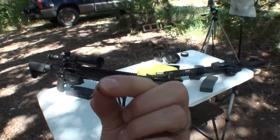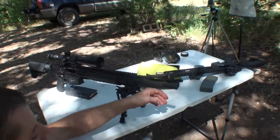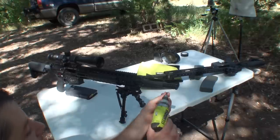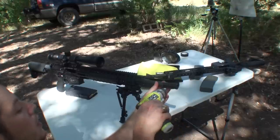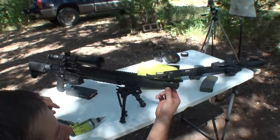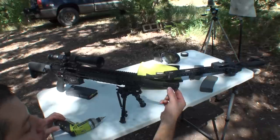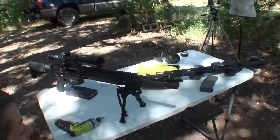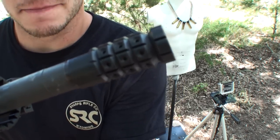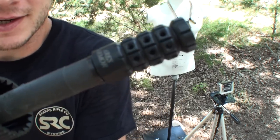Here's what these little plugs look like — they're just little Allen heads and I'm just screwing them all in. Right now I am just filling the bottom and the sides. This row, this row, and this row are open. All the other ones are plugged closed. So all that blast should come up this way, pushing the barrel down this way. It's probably a little too much — it's probably going to push it too low, but we'll find out. I have it set up this way on the 5.56 and the .308. This is the bottom, these are plugged, and up top right there they are open.